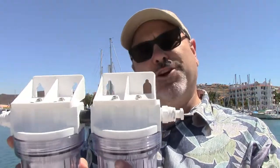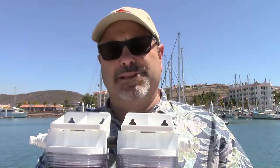When you mount these, they need to be vertical — otherwise you're not going to be able to get the filter element inside to line up and stand up straight when you go to put a new element in. So they need to be mounted vertically. In terms of where this goes in the system, the outlet of the boost pump is pushing through these pre-filter elements, and from the outlet of the pre-filter elements it goes to the high pressure pump. So it's part of the inlet low-pressure water loop of the system.